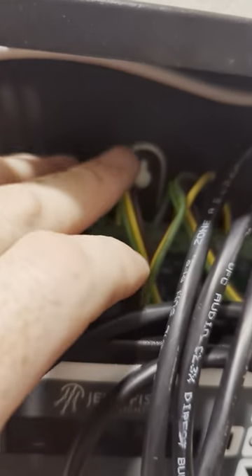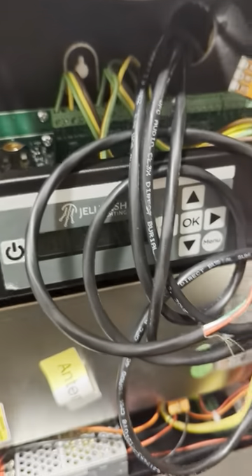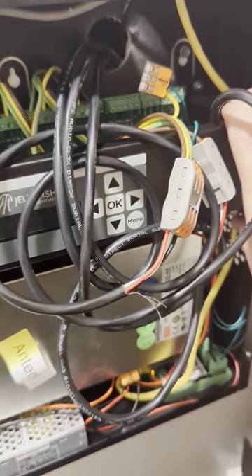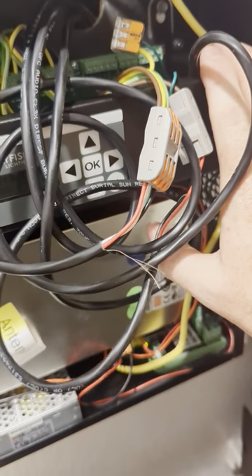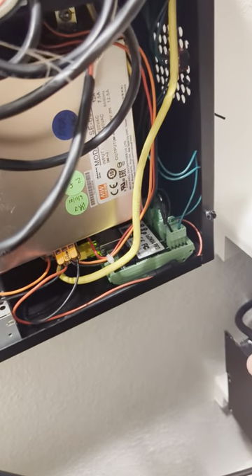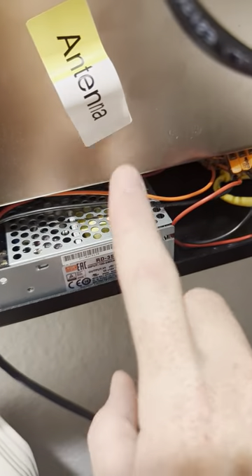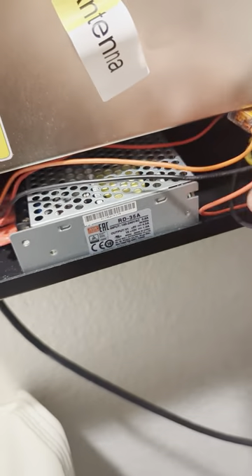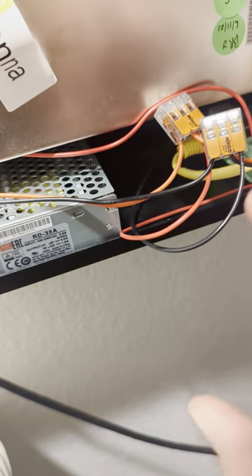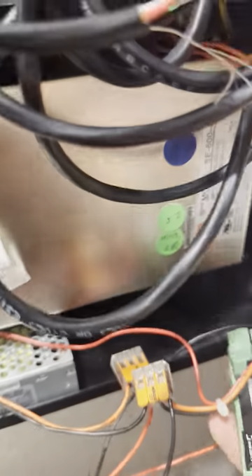I have three physical runs of LEDs, and in normal operation this all works fine. But I want to sync with music — I want this as part of my light shows, and I don't want to double-hang lights on my roof line. I went into this installation wanting that from the beginning, and thankfully Jellyfish was able to help me figure out a way to do it before I invested in the system. I've got another device in here taking power from the 12-volt side of the 5/12-volt power supply. It was very important to me to use the existing power supply since it had extra capacity. All my commons and grounds are together, so I don't have to worry about anything shorting out.